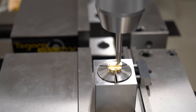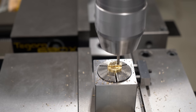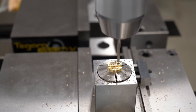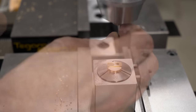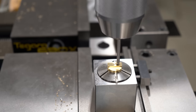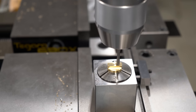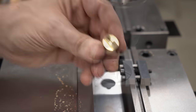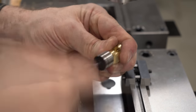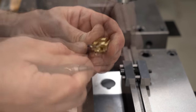Once we've got the center located, I can dial the offset to where the hole should be and drill and tap it. Start with the same 120-degree spotting drill to establish a good spot, then push through with the tap drill. I'm going to drill through both sides of the part - the drill exit hole on the other side may not be perfect but it'll be good enough. I'll tap halfway through, then flip the part over and locate the hole with a pin, since it may not be exactly in the correct position from drill wander. Then I'll power tap this with the same spiral point tap, and the machining on this part is done. I'll use a rotary countersink to clean up the threaded holes and a deburring blade to go around all the other edges. That looks pretty good - it only took two tries.